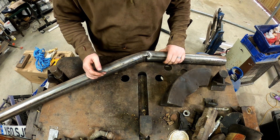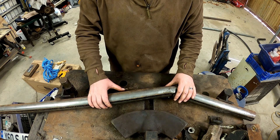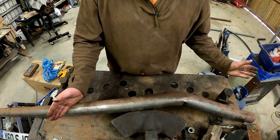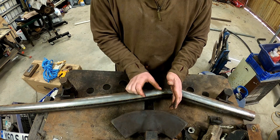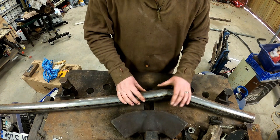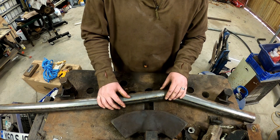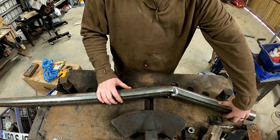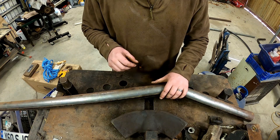That didn't go too well. I thought about putting little lobster cuts in and doing lots of them so that over a certain length it curves 90 degrees. But I also thought: what if I just try to bend in little bits, frequently, and hopefully get a reasonable bend radius? I've written this piece of steel off now, but I'd rather practice with this because it's already written off. Worst case I can cut a piece out and plate over the top. We'll just do lots of little bends, little and often, and see how we go.